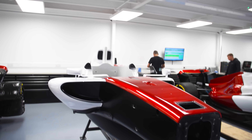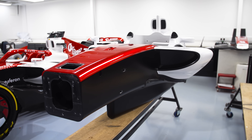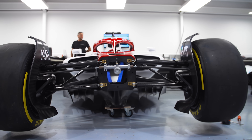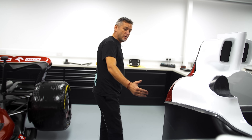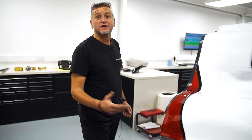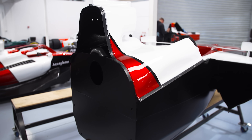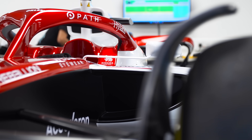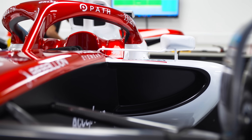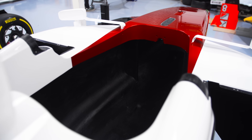The main thing that comes from the paint shop is what we call a chassis or tub. We build from there, fitting cameras, aerials, wishbone fixings, and a steering rack at the front. The engine frame bolts onto the back face and effectively replaces what would normally be an engine and gearbox assembly. On a Formula One car, all the suspension is fixed to the gearbox — because the show car doesn't have a gearbox, it fixes to the engine frame. We call these the pods; normally a proper car would have radiators and coolers in there, but here it's just a shell that looks good.